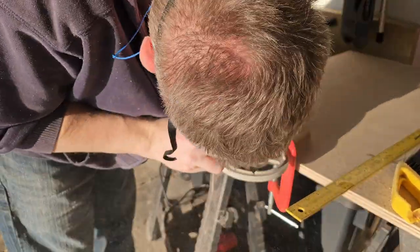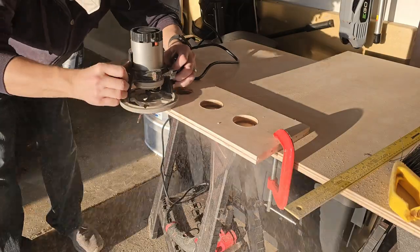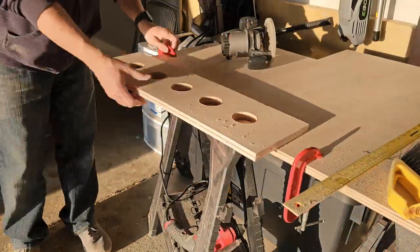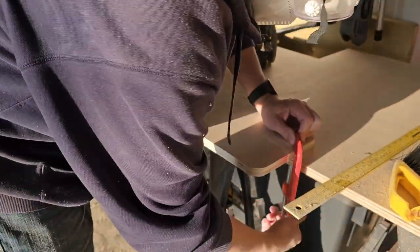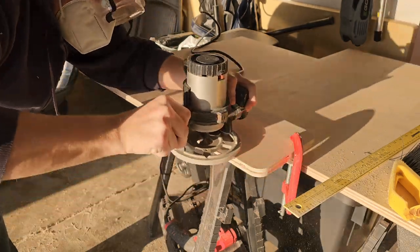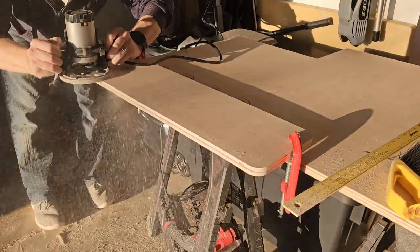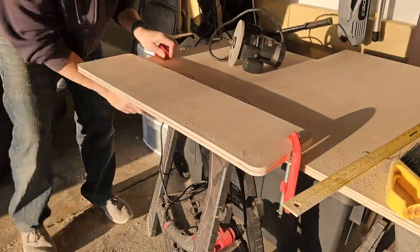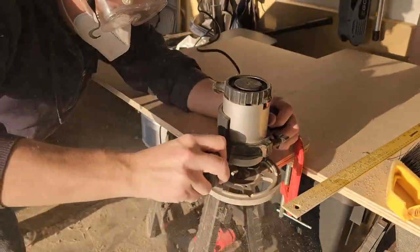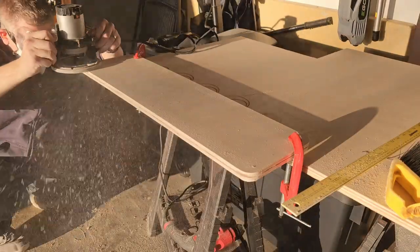Using a router and a T-molding bit, I made channels in the forward edges of the top and bottom panels. I figured I had more than enough T-molding, and I decided that rather than having rubber bumpers like a Stern cabinet for transport, the T-molding would work just the same. I then cut channels into the side panels as well. This T-molding will eventually lock in artwork to the wood, and I did this more as a future-proofing measure than anything else.